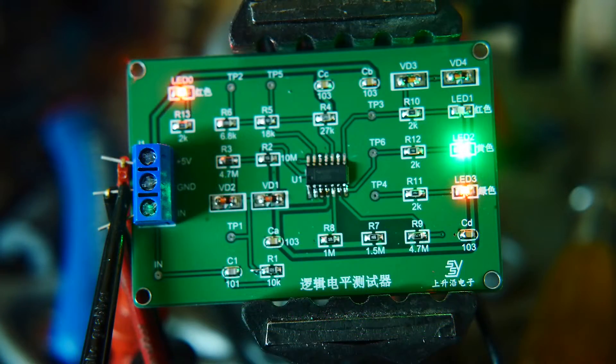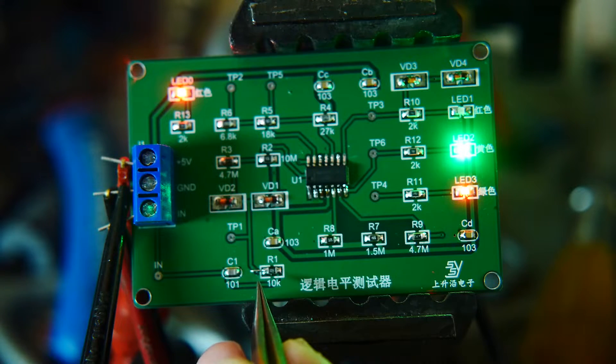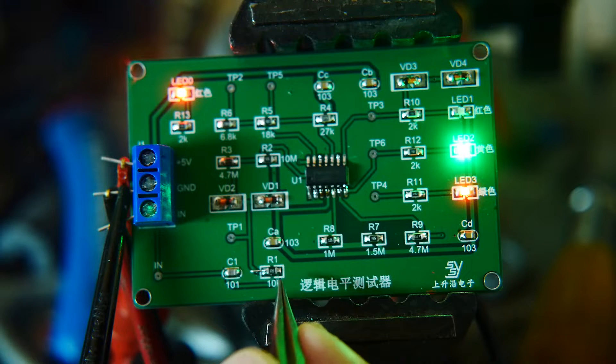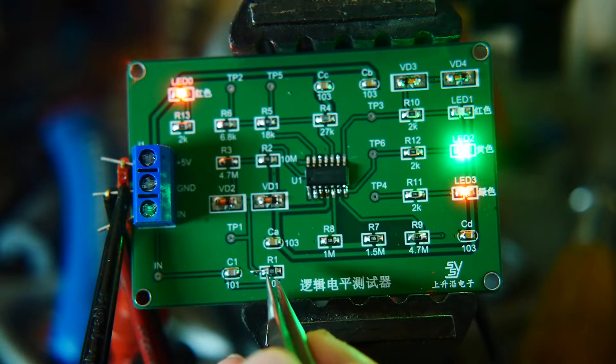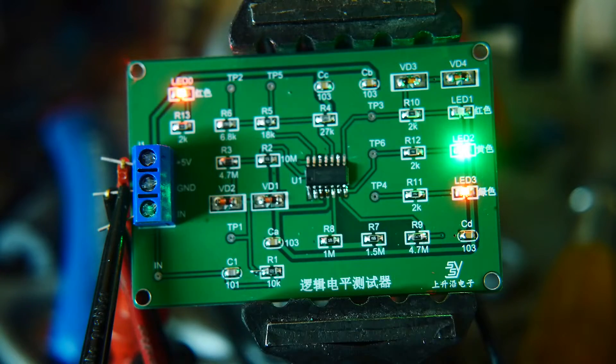I found the error. It looks like the PC board was not manufactured correctly — it just looked wrong. The error is right here next to R1. It's a 10K resistor, so the input comes in, gets buffered with a capacitor to ground, and then goes through a 10K resistor. There was a break in the trace out of that 10K resistor, so it didn't get to the rest of the circuit. I had to put a little bridge there to connect the trace, and once I did that, I got the board working.